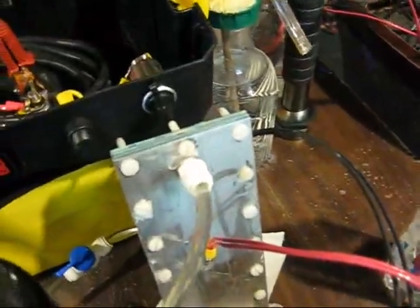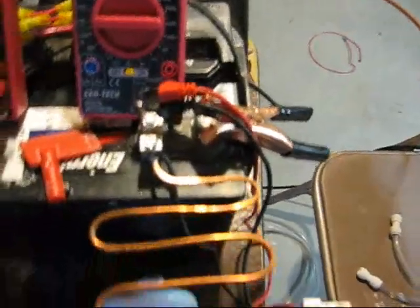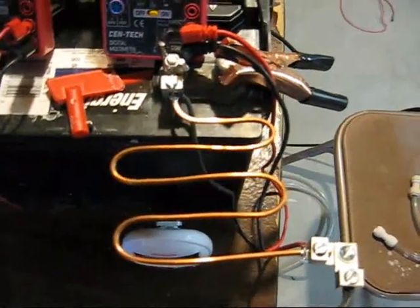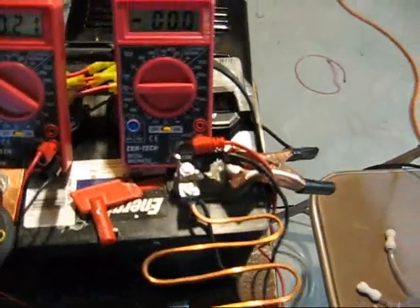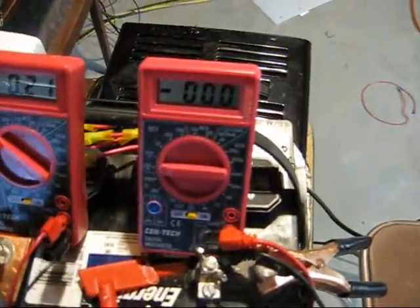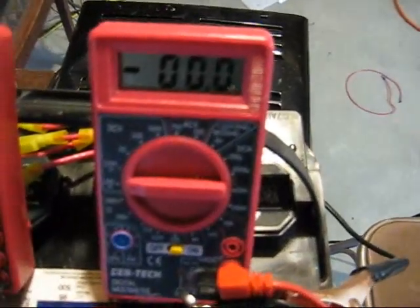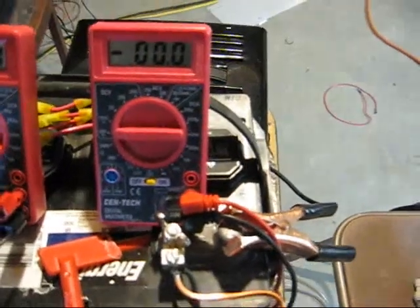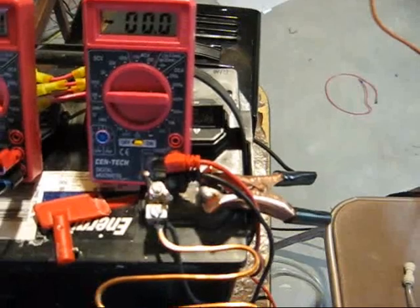This also goes over and feeds power to the cell. On the right side there's my homemade shunt, calibrated with my Fluke meter so it's a fairly accurate shunt. I also put it on a milli-ohm meter to verify its calibration. I'm measuring in millivolts — millivolts per amp — that's how I set it up.